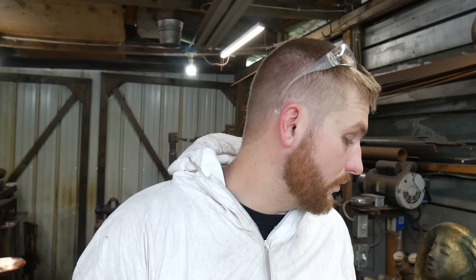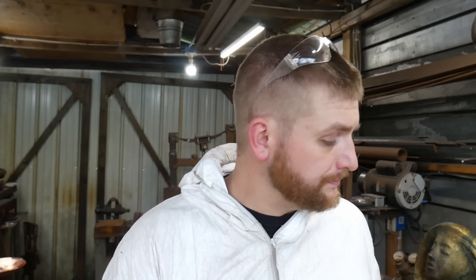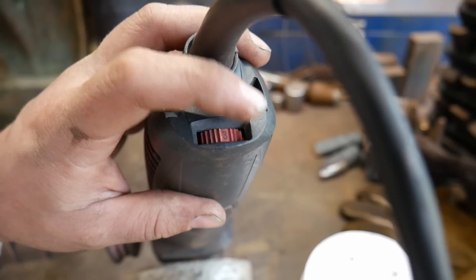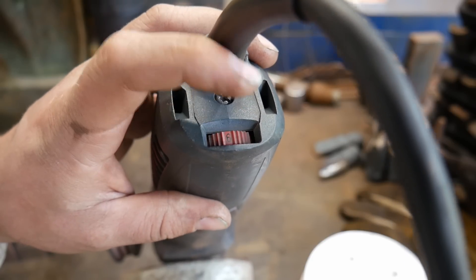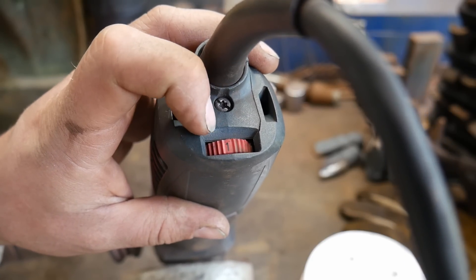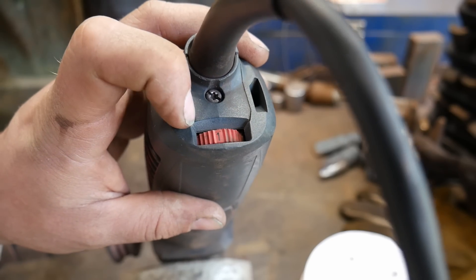One of the other things you can do to help prevent smearing copper, if you're doing any sort of copper work or fine metal work, is to have a variable speed control on your tooling or equipment. You can adjust the speed at which the thing runs. That is a huge help.